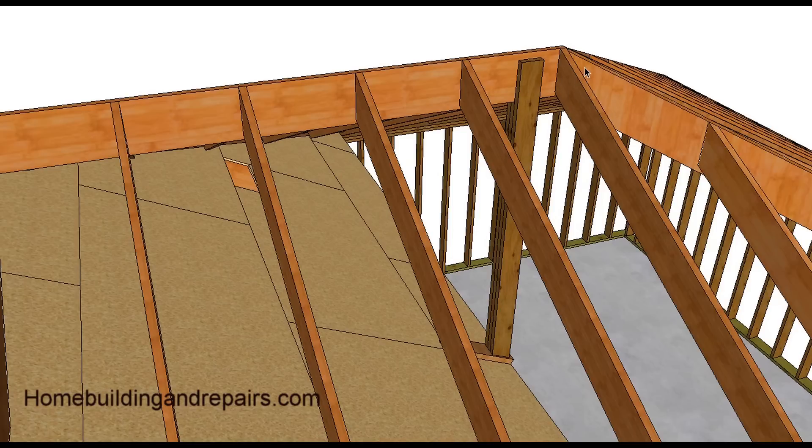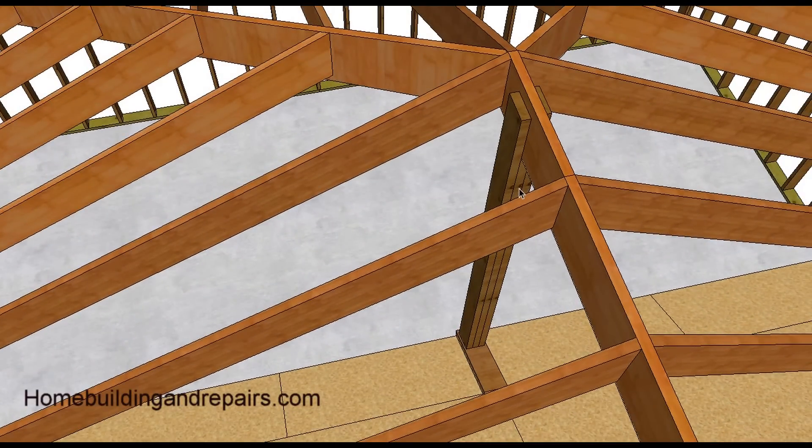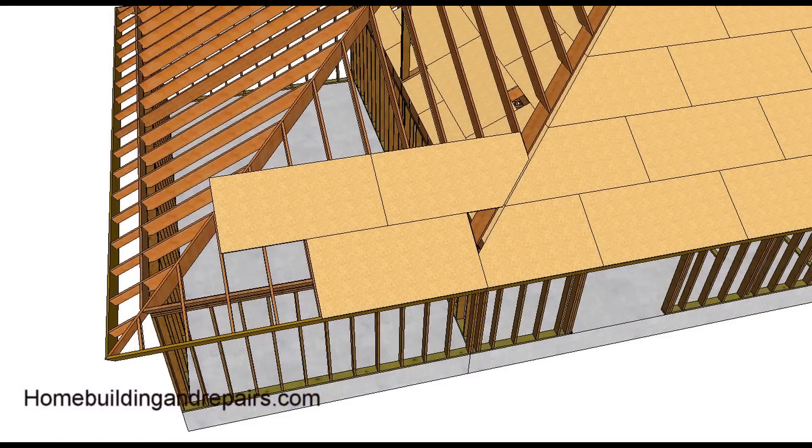It's nice to use support boards to take some weight off of the roof, especially for the ridge. Get as close as you can to where the hips and everything connect. The support shown here runs vertical, though you could move it over at an angle. I'm using a two-by-six under the ridge and then two-by-sixes on each side — this creates a nice sturdy post when nailed together. You could also remove the sheathing and run these all the way down to the top plate of the existing wall.